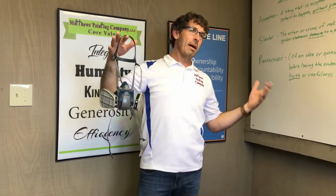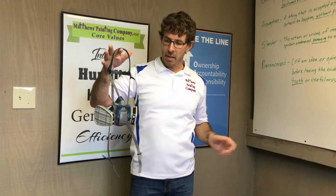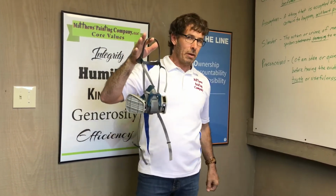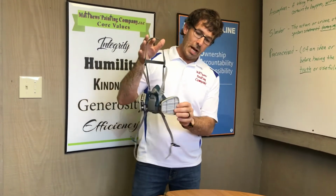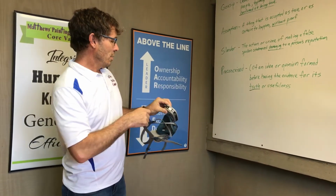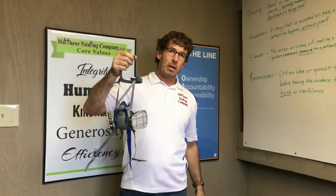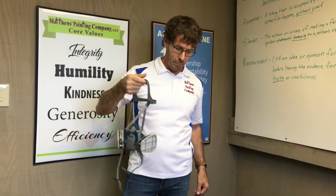Again, this is if you're inside, for example, and you're working around denatured alcohol, lacquer thinner, xylene, naphtha, a lot of different chemicals that can hurt your brain, hurt your body. This can protect you quite a bit from that. Maybe not 100%, but quite a bit. And then these should be changed out every so often, and there's a place here that you can actually put a date on there, and your safety consultant or even 3M could tell you how often to replace those. We always keep many down in our storage room.